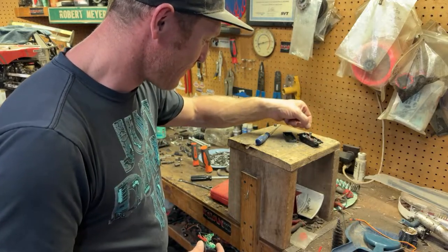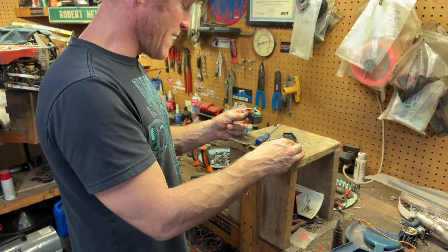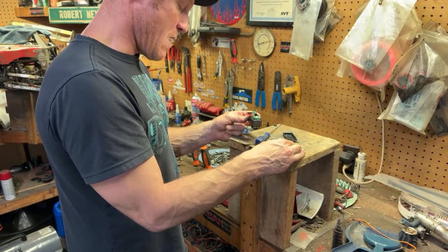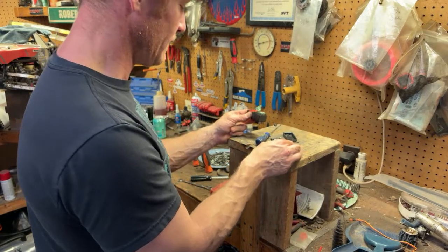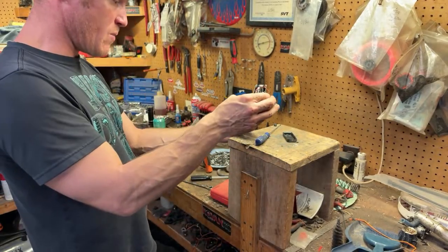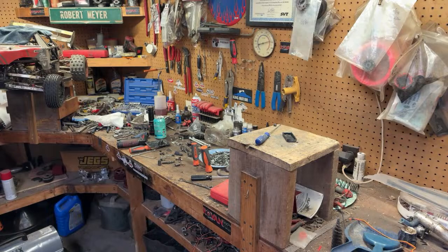Oh, that's funny. So that's what happened. The solder broke, and then it looked like initially we lost that resistor, and that resistor probably caused the other wires to heat up too much or something. It was drawing too much current, and the solder broke on the 3 wires, and the servo failed. That would be my diagnosis on it, guys.